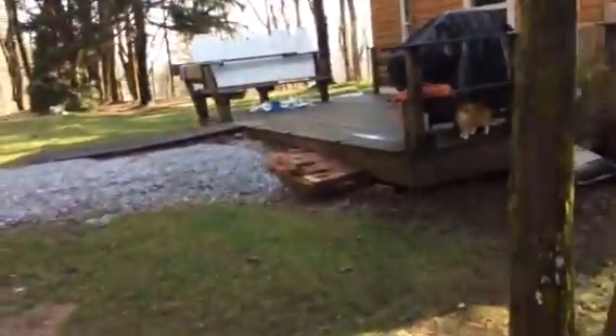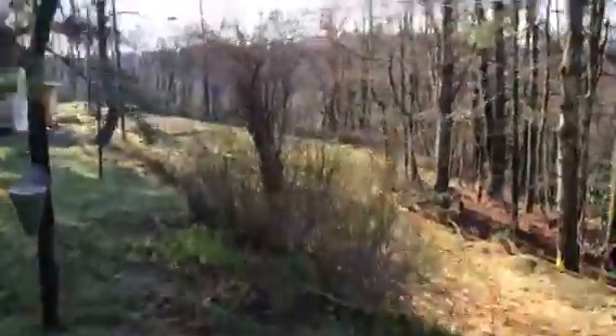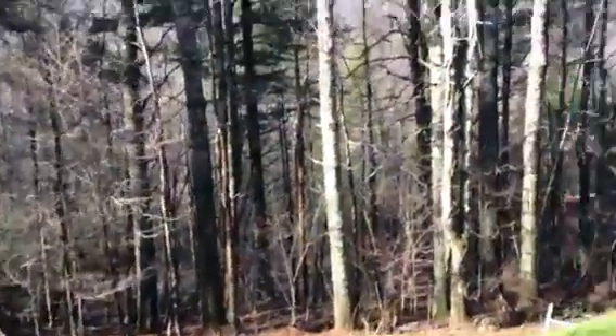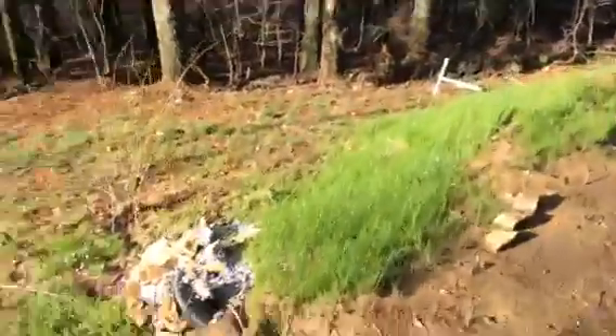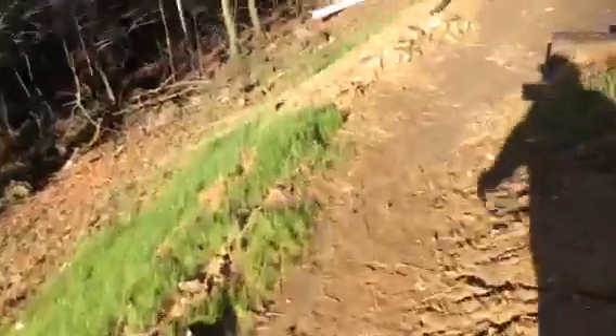Remember, the French drain has about three inches of gravel under its corrugated four-inch pipe and nine inches of gravel over it. This drain held out well — only a little bit of washout, a tiny teeny bit.